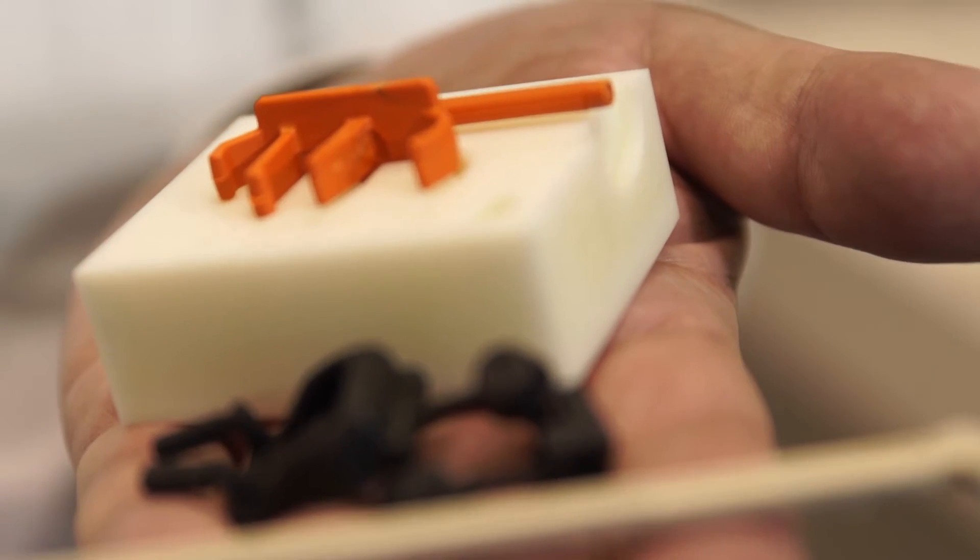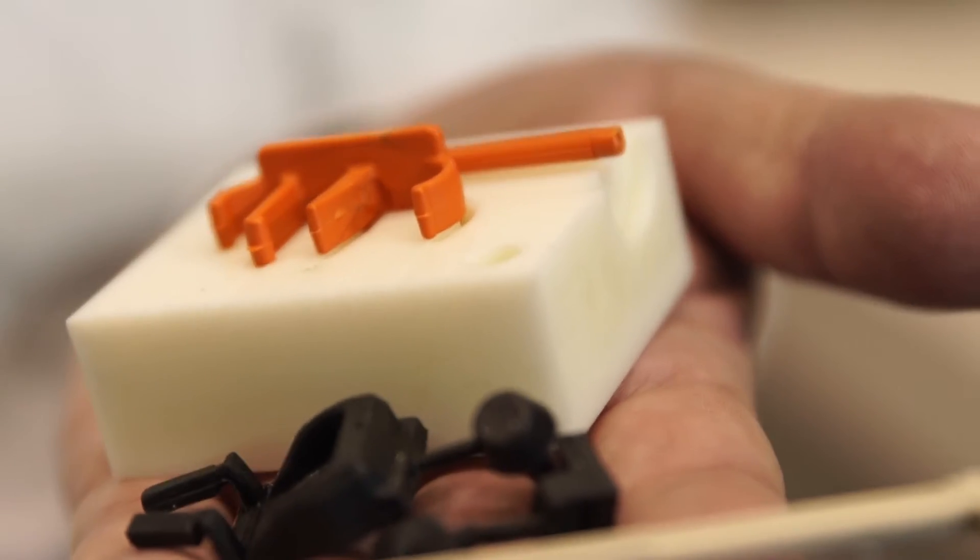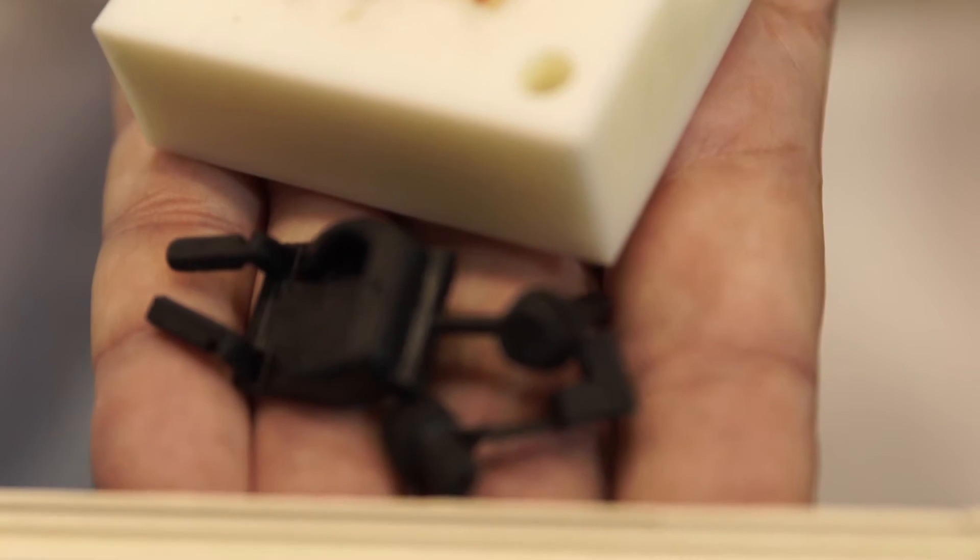We'll do micro-molding in the printed molds. Any of our quick turn prototypes, we make 100% to print, out of the proper material, no modifications whatsoever to the parts. We call them production equivalent parts, generally in one to two days.